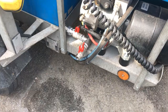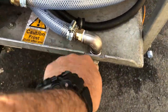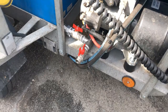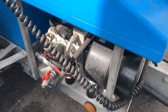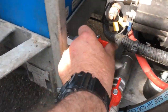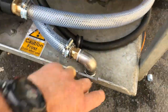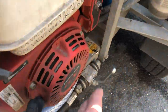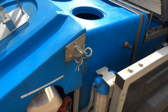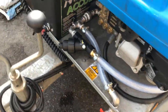When you've finished off in frosty weather, open this valve up, open this valve up. And if you want to drain the tank off, open all three valves in that position — so you're frost protected and the pump is completely open all the way through the system. All those valves now are in the open position. Fill your tank up, close that off, your tank is open and full of water. Make sure this valve is in that position as well — it will then set itself sucking once you've opened this valve. Use the valves to get them open and get the air out of the system — it will then start a lot easier. And this filter is on the return side, so keep an eye on that — as it's coming back on the dump side it comes back into there. Thank you very much, Q Services, Q Washers, eBay and YouTube.